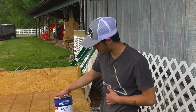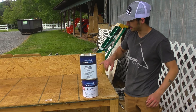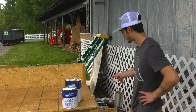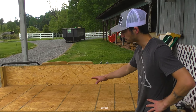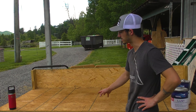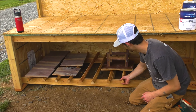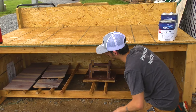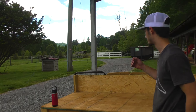This is what I mainly spray — Total Boat Lust. I do 50% Total Boat with brush thinner and it comes out with great finish quality, super easy to spray. I just have a cheap $20 spray gun from Amazon but it works great. I also made this spray table out of a free pallet — these boards are all loose, cut at 45 degrees, so I can spread them out and lay material up to eight feet long.